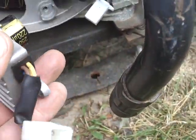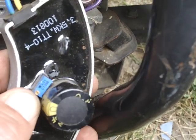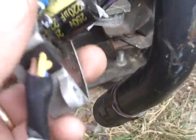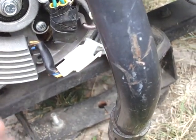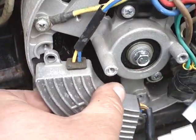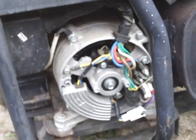You set your voltage right there with that little tiny screwdriver — you can set it for 120 or 125 volts. You can actually set it higher if you want to use the generator for some special purpose. I've turned it all the way up and it'll throw out 240V, however these generators don't have the amperage like the big generators do. Running one of these that hard is probably a bad idea — it'd likely take out the AVR and could take out your windings. It's better to run these generators just as what they're made for, right around 120 to 125 volts.